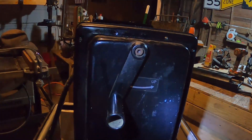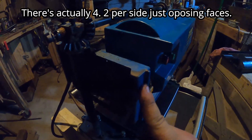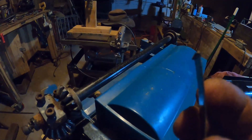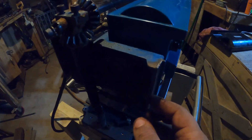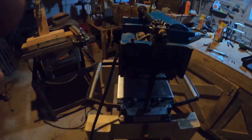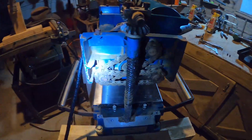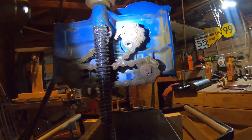One thing you need to watch out for while taking these side panels off: there's one retaining piece per side and they go right up here on this face with that little flange — see that flange right there on the top. It racked my head trying to figure out where it goes because it just fell out when I took the side off. I just happened to see where the other one fell off from on the other side. On this side you have your chains — the top one is presumably your motor belt, and the other is one of the push or pull rollers.